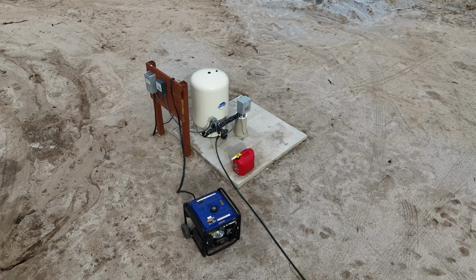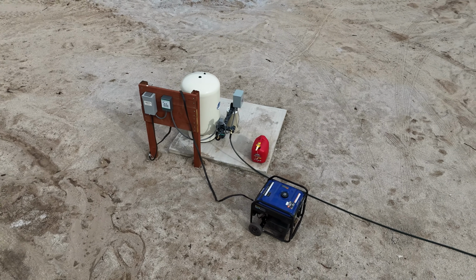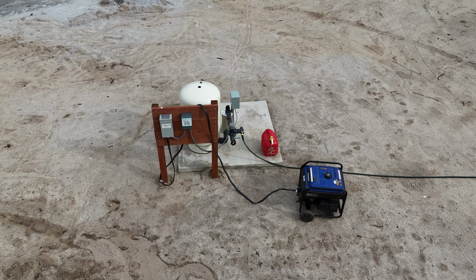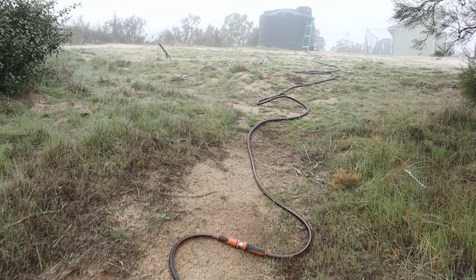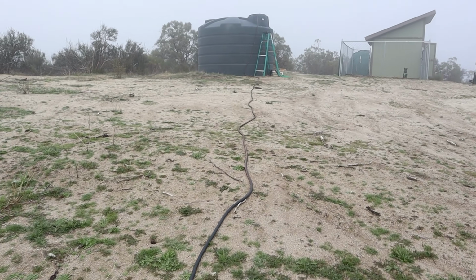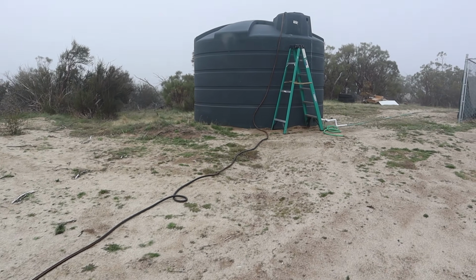Once drilling was complete, they installed a submersible pump and a basic pressure tank capable of moving water up to our storage area. Currently, this runs on generator power, though we may consider making this solar powered at some point. I run about 200 feet of hose up to the tank when I'm filling it. Eventually, I'll install some pipe that goes from the well to the tank. That will be really nice to avoid having to haul this hose up and down this hill.